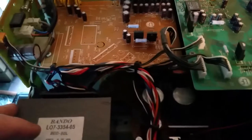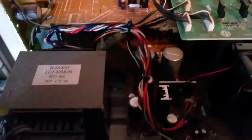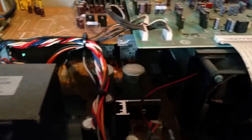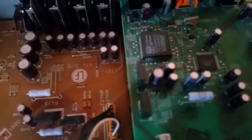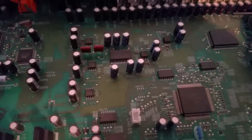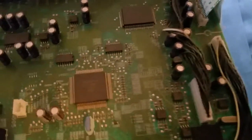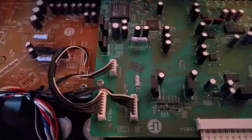What we're going to look at is to see whether or not we can see anything visually out of shape. I had no audio coming out of mains or surround, so our main amplifier board is down here as well. We're going to have a look to see if anything looks out of place. The transistors here don't have heat sinks on them. As I've said in the past, I'm not a big fan of Kenwood.